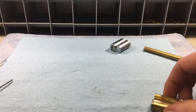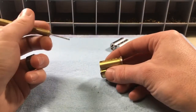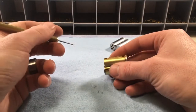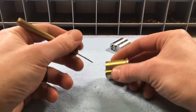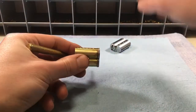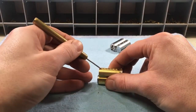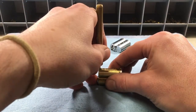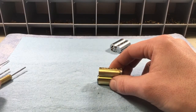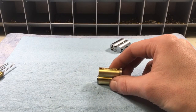If you're like me, I don't actually use any of those pinning blocks. I pin in my hand — I hold the ejector pin in my left hand and the core in my right. When I'm grabbing pins I switch over, grab them, load them in, and then follow up with the ejector pin to push all the way down and make sure it seats properly. I'll go into more detail on that in the recombinating and pinning video.